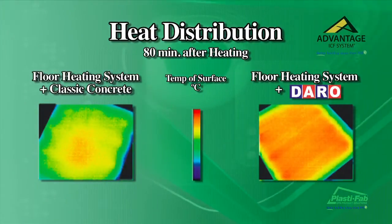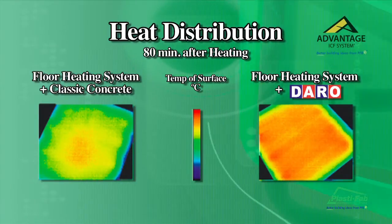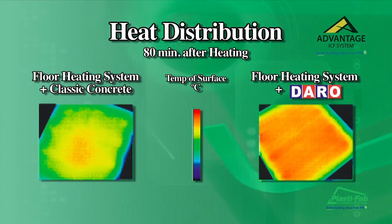The standard is three centimeters of coverage above your tubes. So in effect, that's all you're heating. As soon as you start heating, it's going to be very quick. You're going to have fine tuning and energy savings. And because of that conductivity, the heat distribution through the tubing is very, very consistent. We've seen thermography pictures where they're trying to locate the tubing and you can't even tell where it is — it's that consistent throughout.